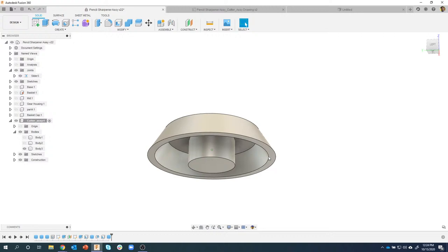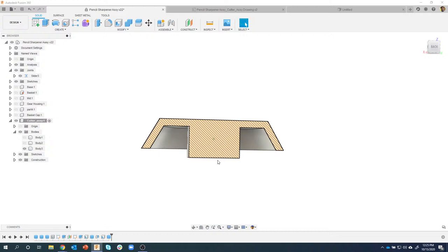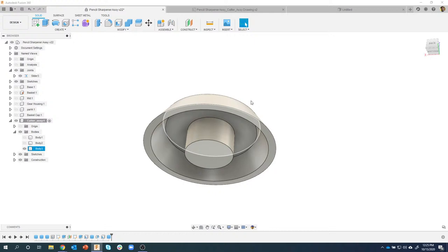Okay. So again, think about what this would have looked like for a sketch to revolve that around. I would have had to have drawn a profile that looked like this, you know, with lots of measurements and angles and all that kind of stuff to create a profile to revolve around. I absolutely could have done that, but I think it's much, much simpler to kind of break it down into its simpler forms. It's a cylinder, it's got some draft, it's shelled out, and then it's got another cylinder inside of that. We're going to learn some tips and tricks like grouping things together and organizing things as we go through here. You'll see that a little bit later, but like I could, for example, group all of this stuff together if I wanted to. But you'll see that more as we move on.